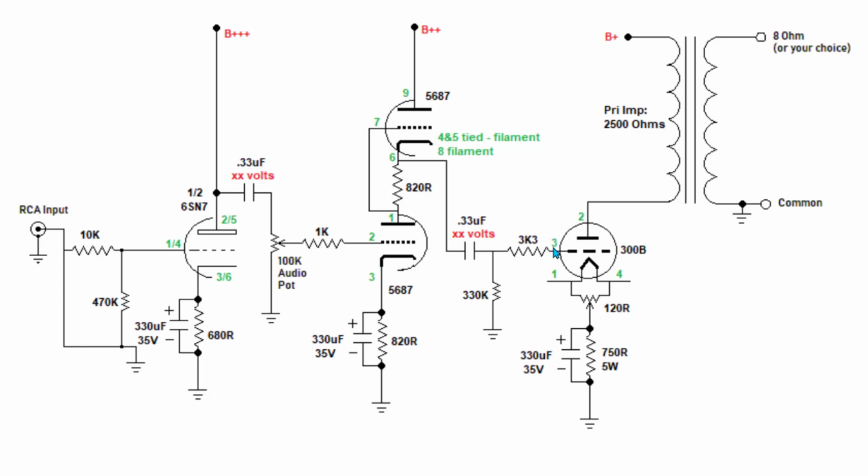We measured on the other side here of this grid resistor going into this. We also measured the B plus at the top of the output transformer and here at the plate, right? We measured our DC resistance here and here, right? Didn't see anything out of whack at that point.